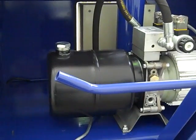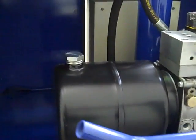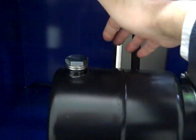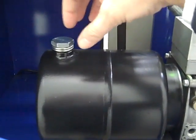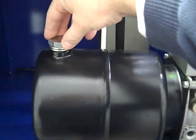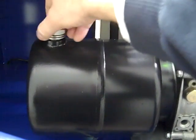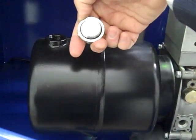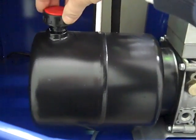You can see the black oil tank here — it's a reservoir for hydraulic oil. On the top you can see there's a steel bung, and you must remove this bung. Basically when the motor is working, oil will run from this tank down inside the machine, and this bung makes it airtight. This is only for transportation purposes. When it gets to you, you must remove this bung — it'll be quite tight, you might use an adjustable spanner. You must remove this bung before you use the machine; otherwise you create a vacuum in the tank and it can damage the machine.